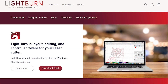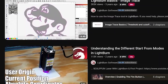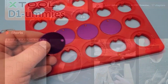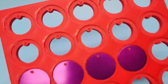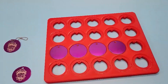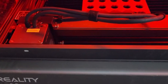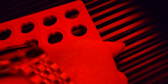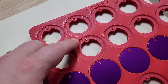To start this project, we needed to learn Lightburn a little bit more in depth. There are plenty of helpful tutorials from Lightburn on YouTube — they were a big help. For the keychain project, we had to understand layering and how to add steps to the program. For consistent positioning, we decided to design a holder that would burn 20 keychains at a time. We layered the art and used our 3D printers to make a jig. We then set the laser height to the engraved cutting setting of one to three millimeters. Aligning the jig is difficult due to how the cutting bed is — the slats move and twist about — so in the future, we will be designing a clamping system to align this better. As it wasn't our intention, we did laser some PLA and quickly discovered that lasering PLA has a very strong smell, even through our carbon filter.